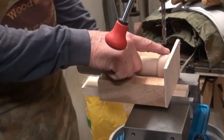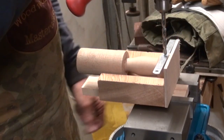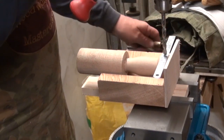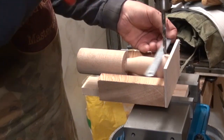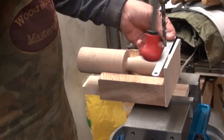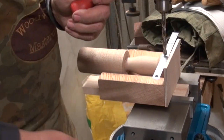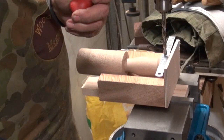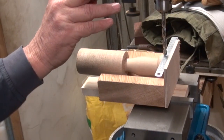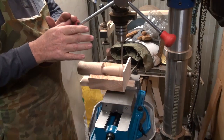To find where the top of the cylinder is — if you put a ruler down and put your drill bit onto the ruler you'll see if it's level. If it's not level you're not in the center. Move the jig until the ruler levels out; once it's level you're looking at the middle of where you want to drill. There's a free tip, and away we go.